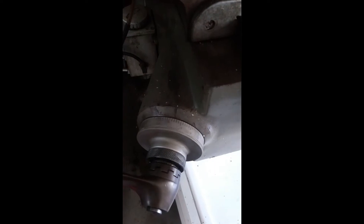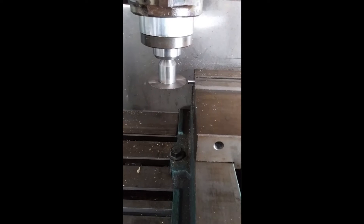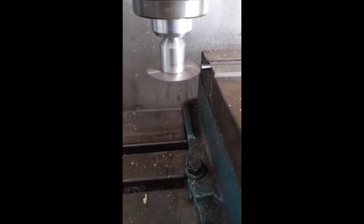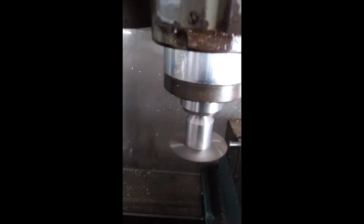Counting up: there's 100 thousandths, 30, 40 — there's 50, 55, 56 thousandths. That should be dead center. It's hard to get the camera in there but from my angle it looks right. Let's fire this up and see how it goes. Of course you always want to turn the slitting saw pretty slow.